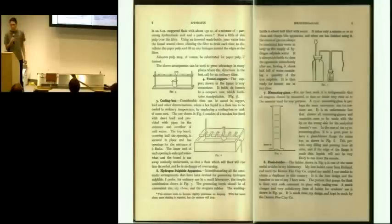And it's also a lot better than using cameras for scanning, because cameras, even though they may have a certain number of megapixels, each pixel is actually red, green, or blue. And in these scanners, when you say 300 dpi, you're actually capturing all three colors for each pixel. So it works a lot better. It has much higher quality. And these sensors are only like $20 compared to a very expensive camera that you would need.